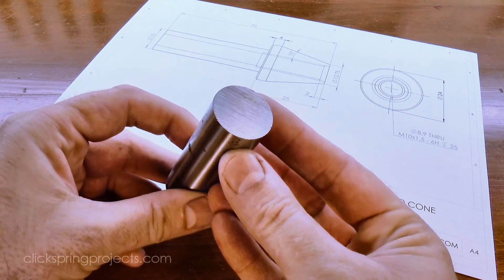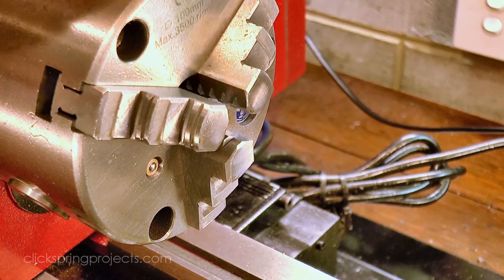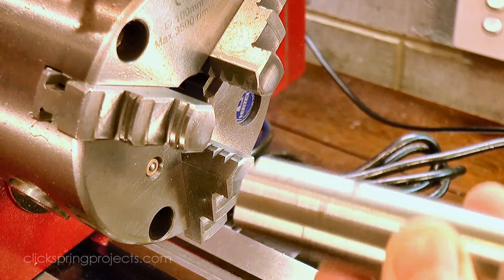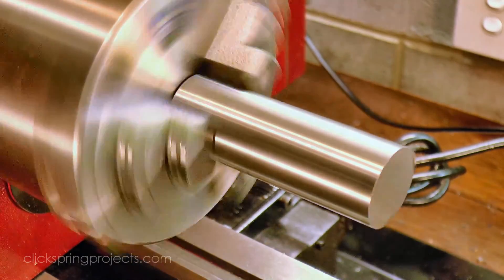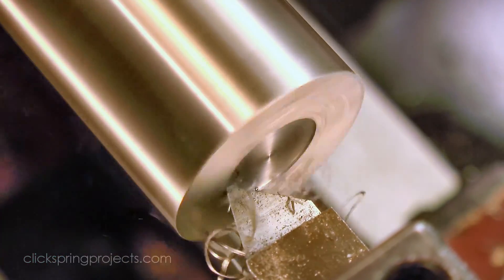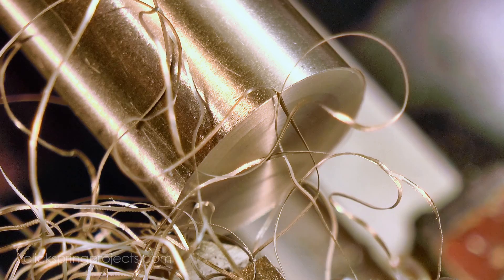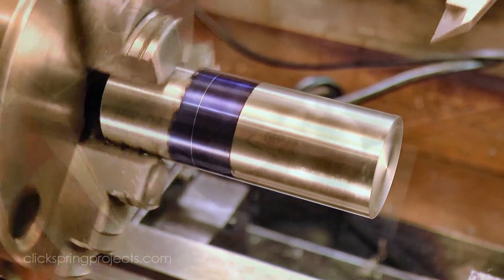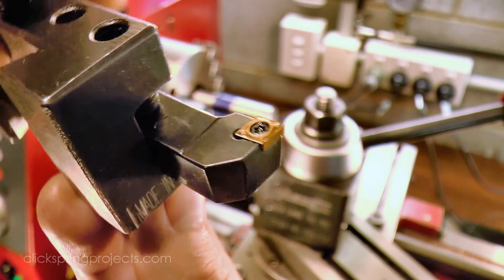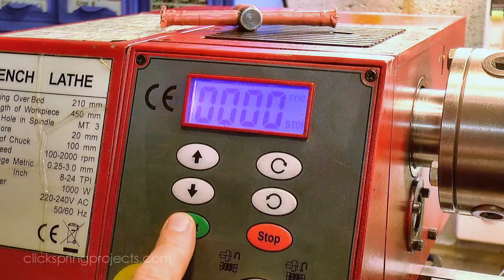Now you've probably noticed that I do almost all of my turning with high speed steel. I like the flexibility of being able to grind any shape I need for the job, and I find it gives a great surface finish. I rarely if ever put in a chip breaker, and usually that doesn't present a problem. But tool steel tends to produce these long stringy chips — they're super sharp, with nasty serrated edges just looking for a finger to cut. So I'm playing it safe and switching to these inserts for the stock removal. I don't use inserts often, but I find the inbuilt chip breaker perfect to sort out this sort of issue.